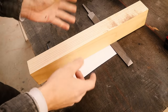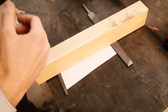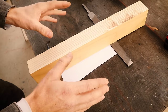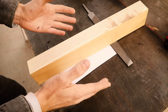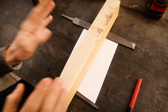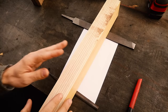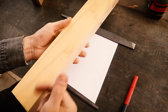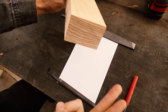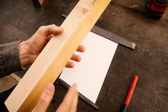While the axe head is soaking in the Evaporust, let's get to work on this handle. When it comes to making handles for tools like hammers and axes, the rabbit hole you can go down about best wood or best shape is basically endless, but I'm gonna give you just the main points for making a handle for a tool that you plan on using. The most important aspect of making a good handle is grain orientation, because we want strength and durability. Typically you'd want to check the grain orientation in three different phases — let's call it primary, secondary, and tertiary. Sounds scientific but it's not — it's just one, two, three.